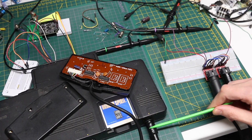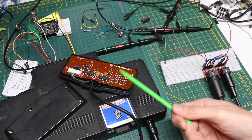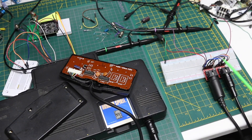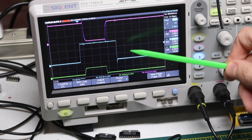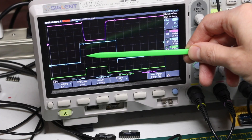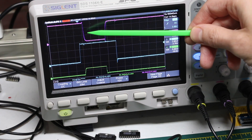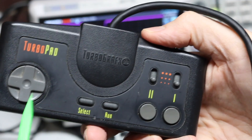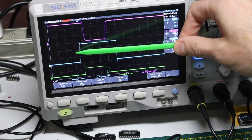I have the custom DIN-8 cable plugged into the TurboGrafx controller port going to the breadboard, and there's another DIN-8 jack with the real controller plugged in — all pins connected. So it's like one long cable to the controller, but I can put scope probes in here. I took the back off the controller, so there are the two chips and miscellaneous components. The bottom trace is the enable to the controller chips, the middle trace is the select which controls which bank of four buttons are being read, and the top trace is the first data pin D0, connected to the up button as well as the number one action button.